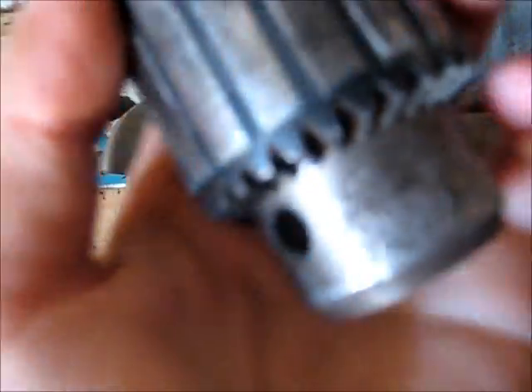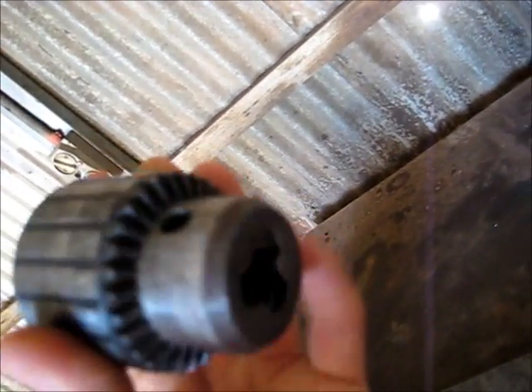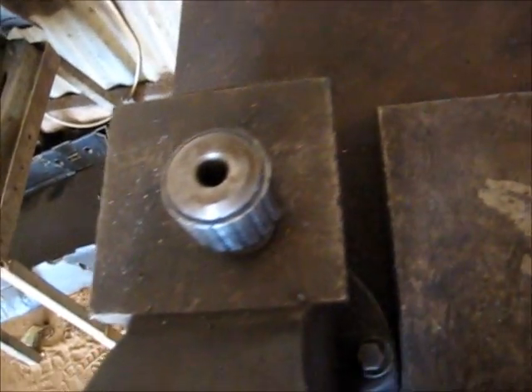We also found this dual chuck, 1-13mm, some Chinese manufacturer. I just cannot get this thing to turn — it gets to halfway and it locks up completely. I started smashing it with a hammer and it worked briefly, then started locking up again. So I pushed this assembly out, which exposes the inner drive gear, and a couple of teeth fell out. That'll explain why it only goes halfway and jams up. I'm going to pull this thing apart.